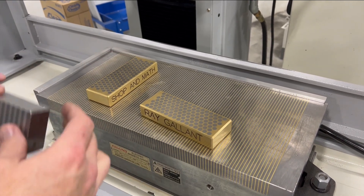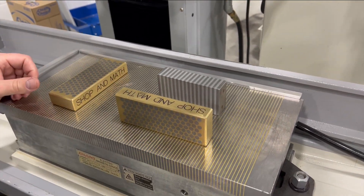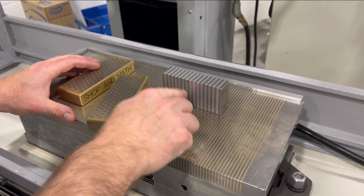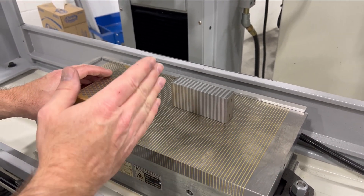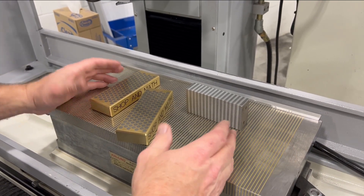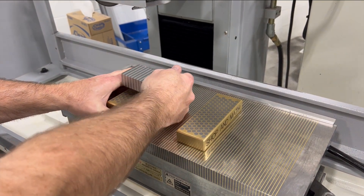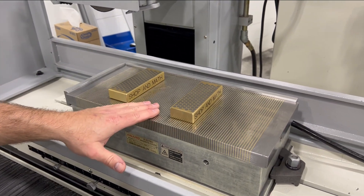There are always positives and negatives. The universal parallels can go any direction, while standard ones can only go one way. The higher you get on these parallels, you will lose a little bit more magnetivity, but that's to be expected. I also recommend blocking them up with a solid plate on the end when you put your work piece down so it can't shoot off, because these are a little bit weaker than the actual table magnet.